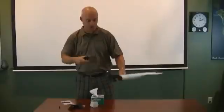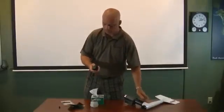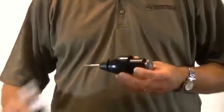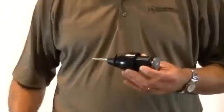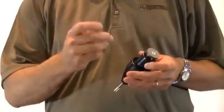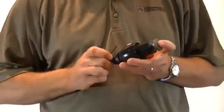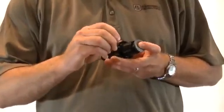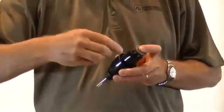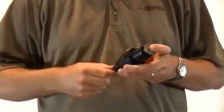Set the housing down. Every wind monitor comes with a spacer and an allen key in a little packing. Using the allen key, back off the set screw that's by the magnet. Pull the magnet off.